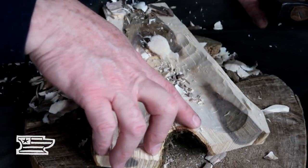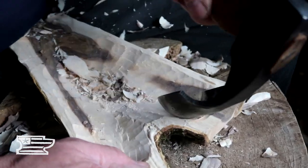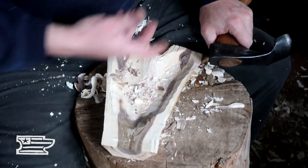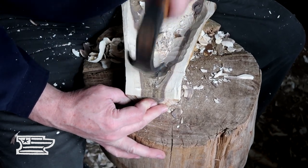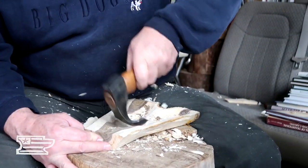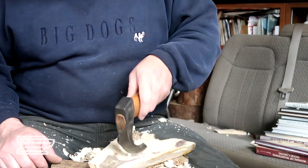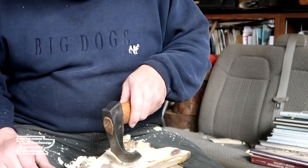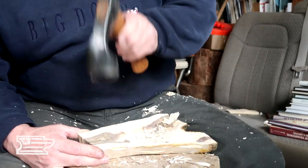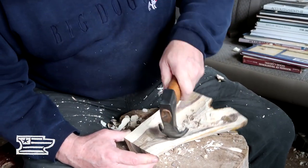This side is a little tighter than the other side, so I'm going to bring this one out a little bit more. When I'm swinging that right at myself, I'm not swinging in big swings — those swings all kind of have a stop in them. So I run out of energy pretty much at the bottom of that arc. These are kind of wrist swings instead of arm swings. I'm just swinging with my wrist, and my wrist only goes so far, so there's a stop. If I was going after this full on with my arm, I could get myself in trouble. So when you're working real close to yourself, it's just things to keep in mind of how you use edge tools.